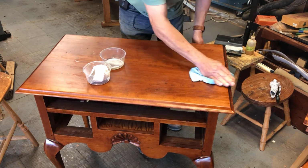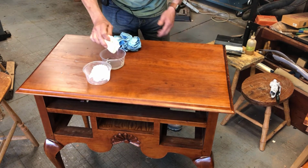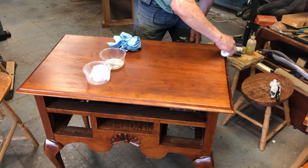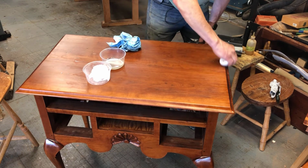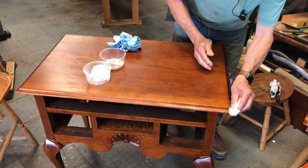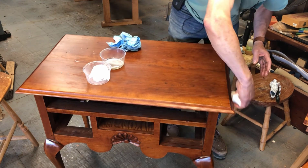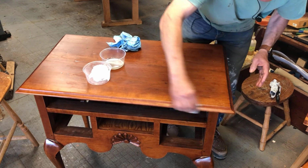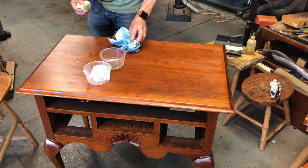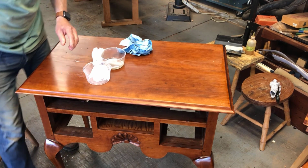Now I'm just going to have to clean that all off. This molding edge needs to be done. It's nice with this little wadding, furniture wadding, upholstery wadding. It just fits into that molding surface real well with the pumice, and clears it up quite well. So that's going to be the last step.